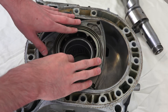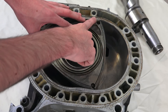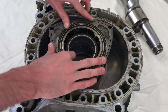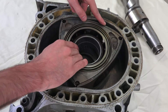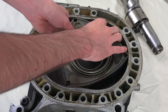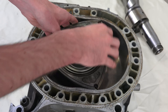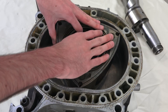Now let's work through the four cycles which need to occur for combustion. First, starting with an empty pocket — the rotor is completely up against the rotor housing with no air in there. As it begins to rotate it starts to open up a pocket, which creates a vacuum, and as it continues to rotate that vacuum opens up to the intake ports, allowing you to draw in air and fuel. That continues until you fill up the entire chamber, then you close off the intake ports and begin compression.